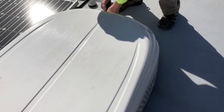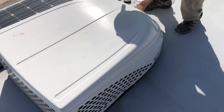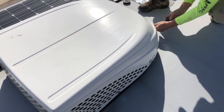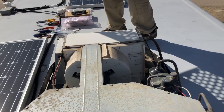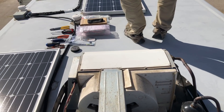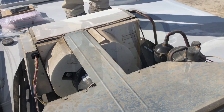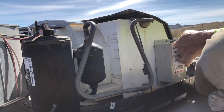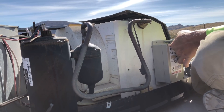After you've read the instructions, the next and most important thing is to shut off the power to the RV — particularly to that AC unit — because you don't want to get an electrical shock. Then remove the cover from the AC unit so you can find a suitable location to mount the Easy Start. The case it comes in is waterproof, so you just want to find a place underneath the AC cover where it will fit.